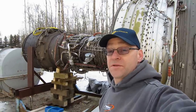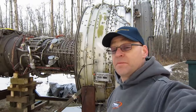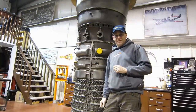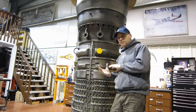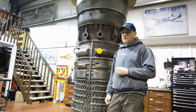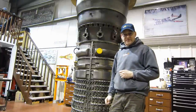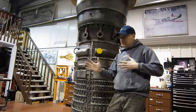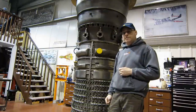It's going to be an organ donor for parts to rebuild an LM2500 industrial engine. Luckily it shares about 90% parts commonality with that engine. With engine pairs like the LM2500 and the CF6, and the LM1500 and J79, it's an inexpensive way to work on an industrial engine by getting a surplus expired aircraft engine of the same pair and using the parts out of it. Nowadays, though, industrial engines are designed to be specialized for their purpose and aircraft engines are specialized for theirs — there isn't any real crossing of the parts book lines. With these two particular engines, we're lucky to have an inexpensive source of spare parts to keep them running essentially forever.